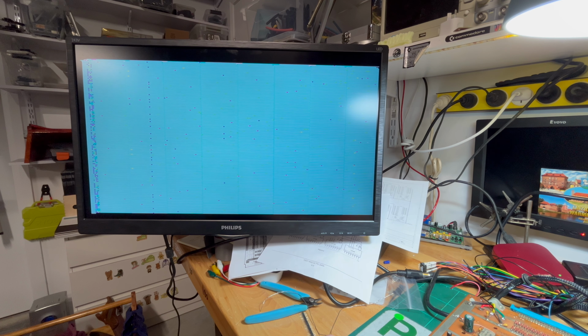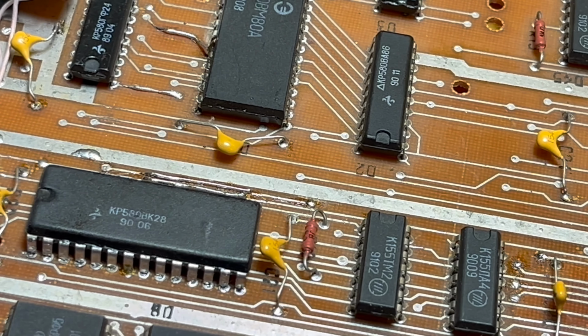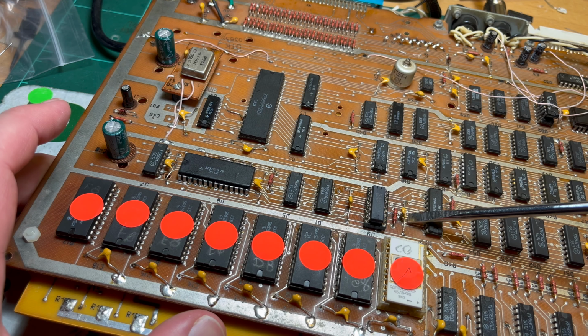That's not good. Excellent, I've made it worse. I'm a bit concerned about, that was what I was seeing before. I don't like that kind of soldering there. But I'm a bit concerned about some of these bypass capacitors or decoupling capacitors. Because they don't use conformal coating, it doesn't take much, just the legs going through. Some of this, like this leg, was almost touching.